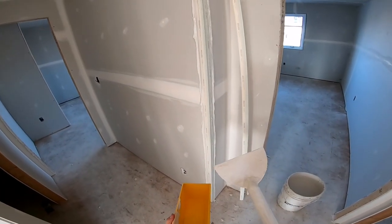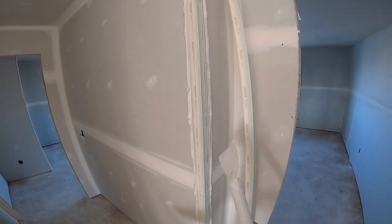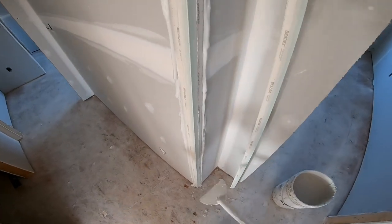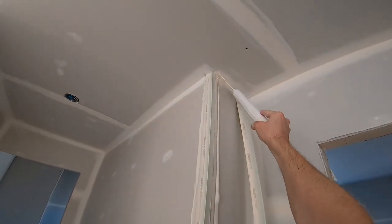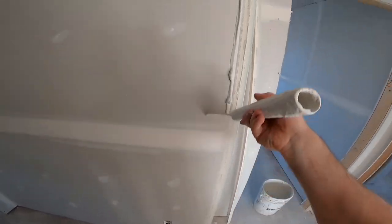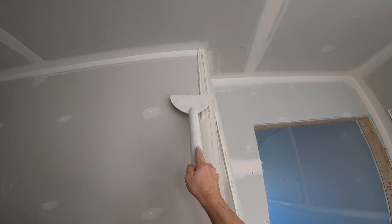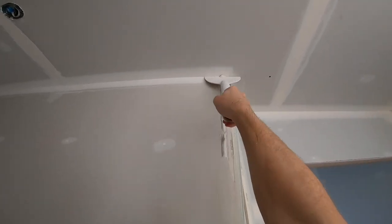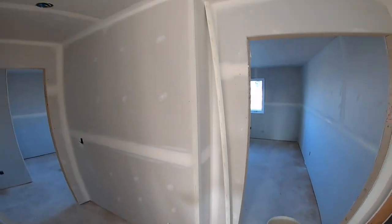Grab the pan and a knife. It's already rolled in — the flanges are tight and the corner bead is tight to the wall. All we have now is this excess mud that's been pushed out, and all we need to do is get rid of that. Normally I would run the edge of the knife right there if putting it on by hand, but now that it's rolled in you don't need to do that. You can put the knife anywhere you want. I just overlap the knife right over the corner bead so I actually get a little bit of a coat at the same time.